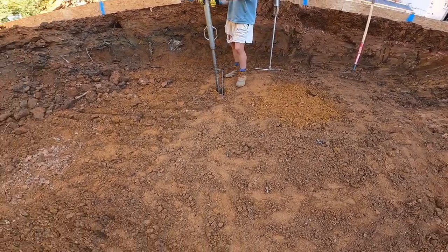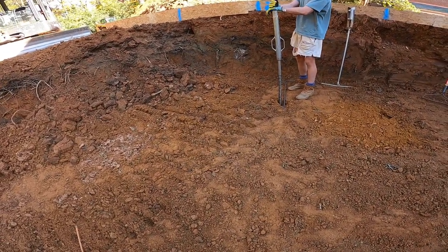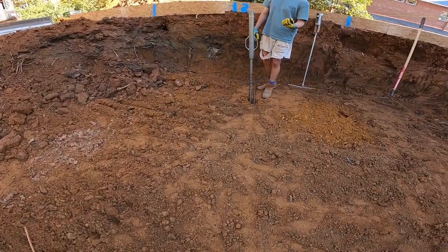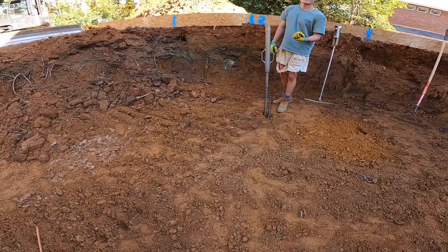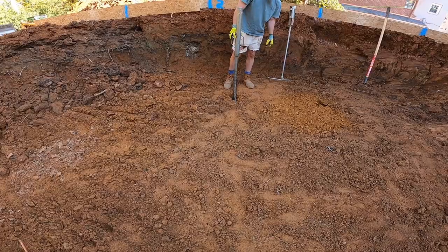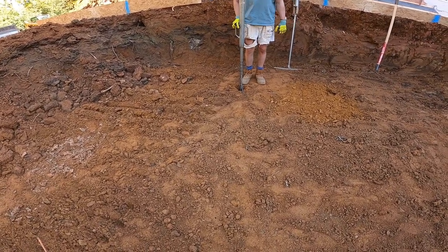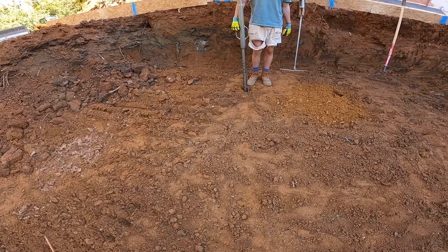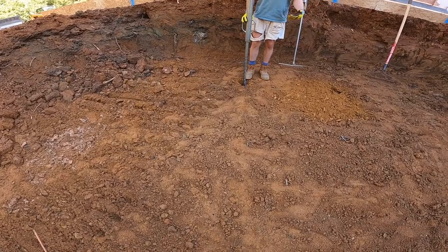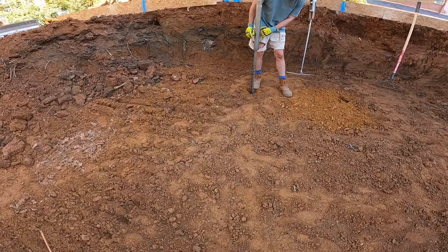Yeah. There's actually a good amount of creeks in the Charlotte area, and they're just building houses everywhere. You'll get residual soils, but they're that light bluish gray, sandy, silty stuff. Anytime you hit that, man, it's bad news. That's usually when you're talking timber piles or caissons, or sometimes they can undercut it if it's just 3 or 4 feet still above the water. Personally, once you hit that 3-4 feet down, you're probably looking at timber piles.